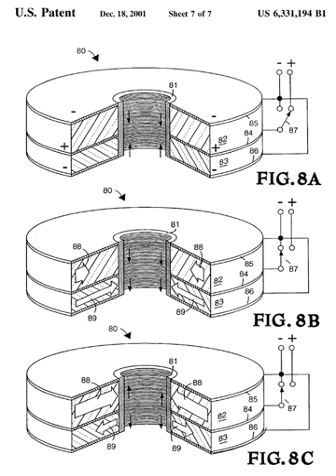The DWA addresses the main issues with current proton therapy systems—cost and size. Depending on the desired final beam energy, conventional medical accelerator solutions such as cyclotrons and small synchrotrons can have large cost factors and space requirements, which could be circumvented by DWAs. The cost estimate for a DWA is about US$20 million, and DWAs are expected to reach acceleration gradients around 100 megavolts per meter.